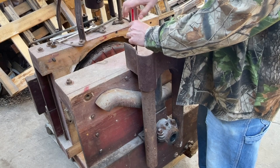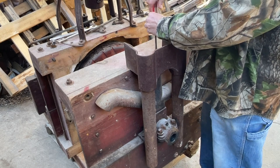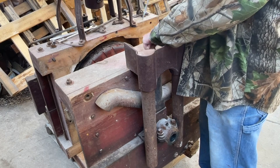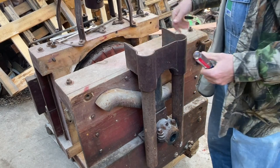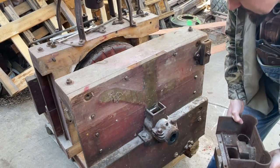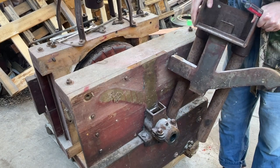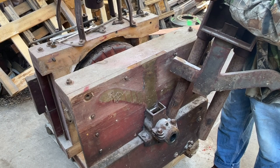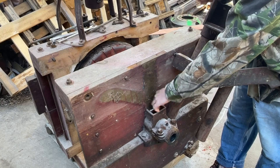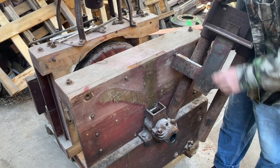There's just two screws that holds all this cast iron on this mill. Just two screws, and I'll show you how that is possible. Two screws in the top right here, and this picks up out of the bearing housing. And the drop where the grain falls down in, this square part, goes down inside of the part on the bearing down into the auger for the shaft.